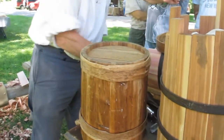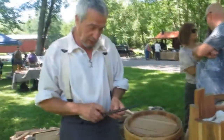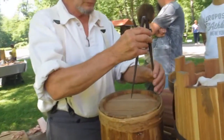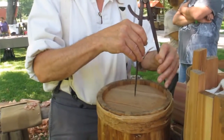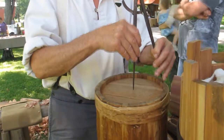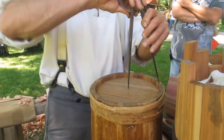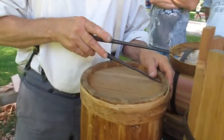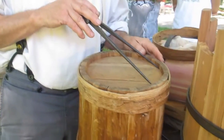then I have to determine a radius. I simply do that by this. Got the divider, and I would first guess about the depth of the Croze, and the Croze's right there. I'm going to come out somewhere around the center. I'm just going to guess. All right, guess. Then I'm going to lock it up. Then I'm going to pick a point here. I'm going to start right there. Now, that's the starting point. That's got to be the ending point also.